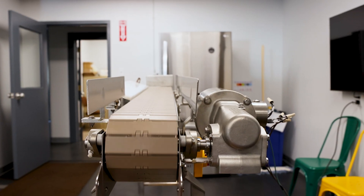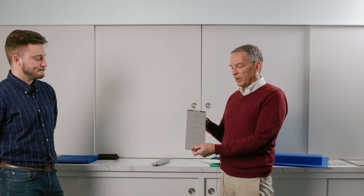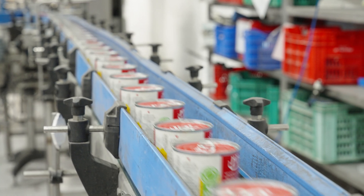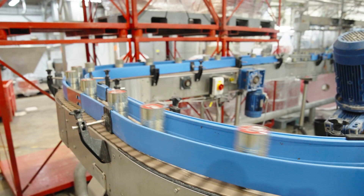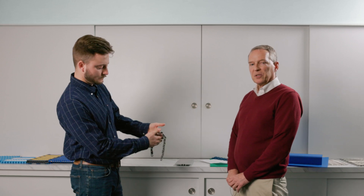Another great alternative to plastic modular is our tabletop belt. It's made out of plastic and this is a straight style belt. These are fairly economical and can go with long runs of belt in this style. You can also get this in a curved style. This is actually a radius style belt made out of stainless steel.